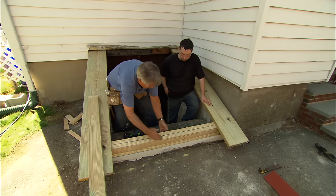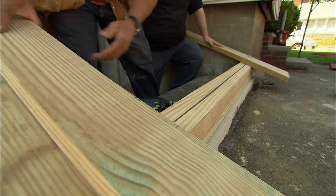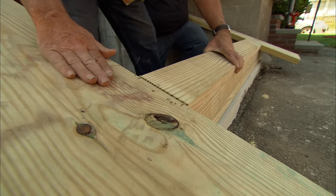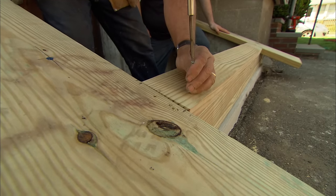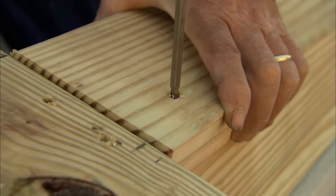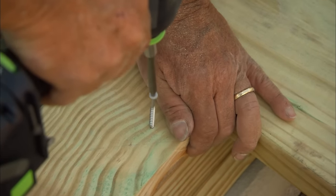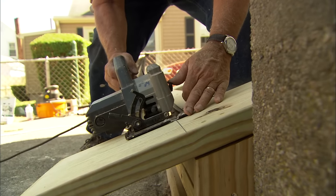The reason I built this little pressure-treated wall right here is because your foundation was damaged at the top of the stairway and I don't want any air or space underneath it. I also have to create a flat surface at the bottom of the stairway for the bulkhead to sit on, and it has to be at the same plane and angle as the sides. And now I'll cut the sides to the right length.